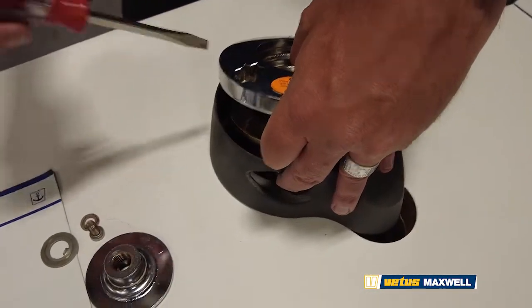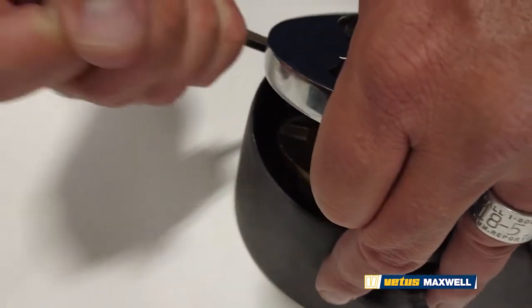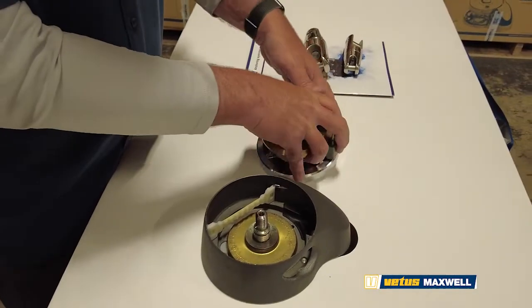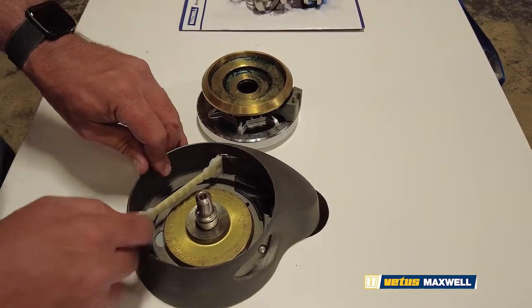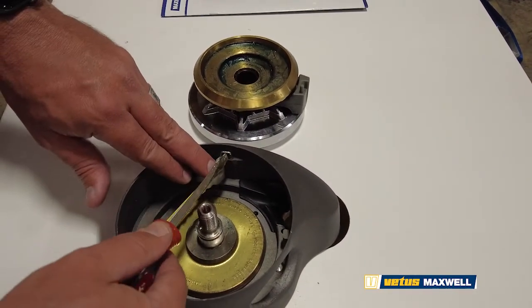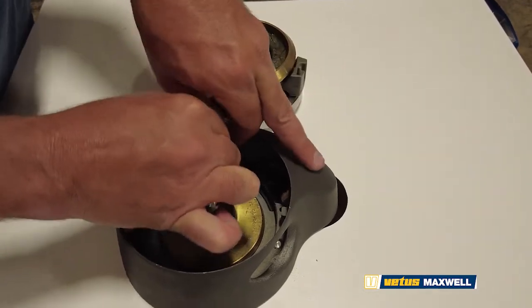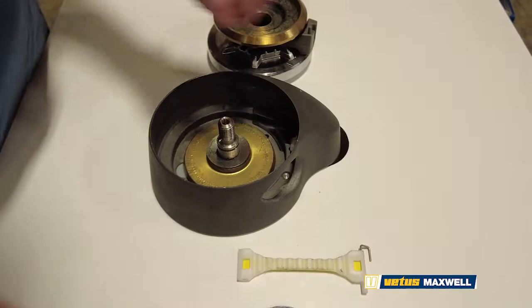The pressure paw will actually be catching on the bottom of the chain wheel, so get your screwdriver in there and push that back. Under the pressure arm inside, and that all comes out. That's your top clutch here. Stripper paw. And inside you'll see we have our pressure arm — probably the reason you're in here to replace this — and then your lower clutch plate. The pressure arm is the next piece that comes out. It's quite easy. There's a little metal pin here; just get your screwdriver underneath and pry that up. Pull this up and the whole arm should come out pretty easily.